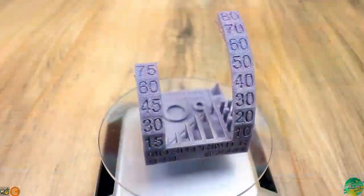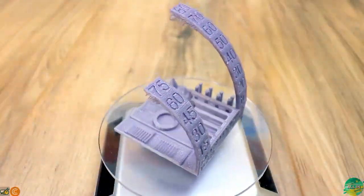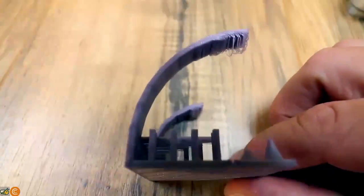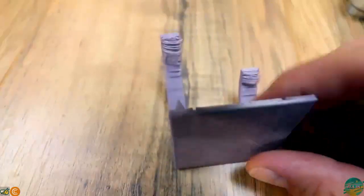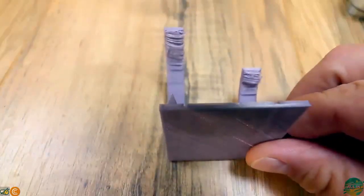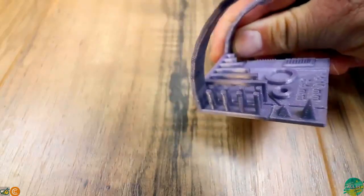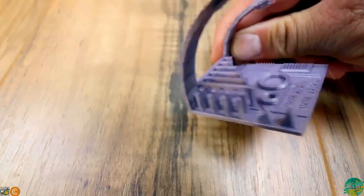But it was not sliced specifically for this using that Prusa Slicer printer profile. So what I did today was I opened Prusa Slicer, and all I did was change the temps and made sure the fan was on because it's PLA 100% of the time. And I got a really good print. So as you can see, the overhangs aren't bad. Up till about 60 degrees, they're great. Everything in the back with the bridging and the letters and the circles and the points look spot on compared to the last one. So the next thing I did was a benchy.